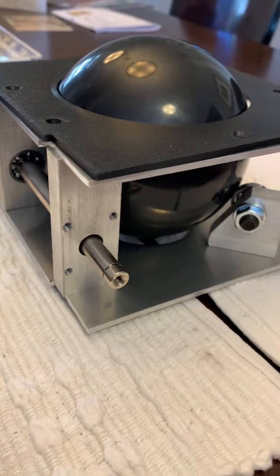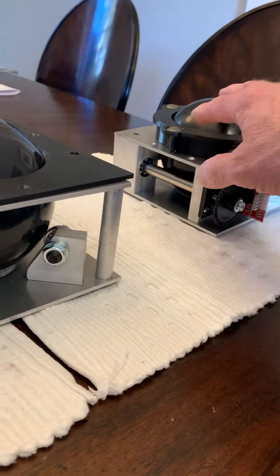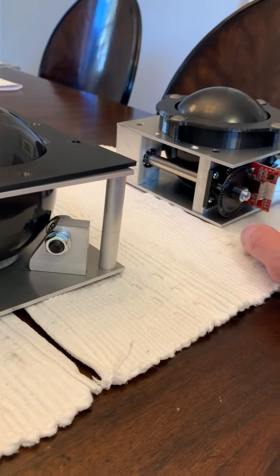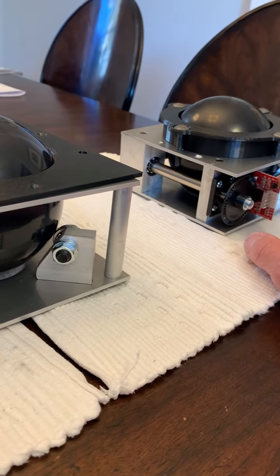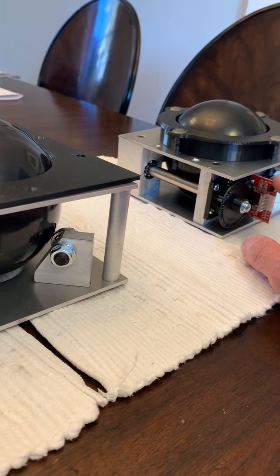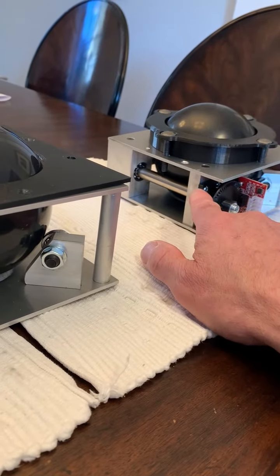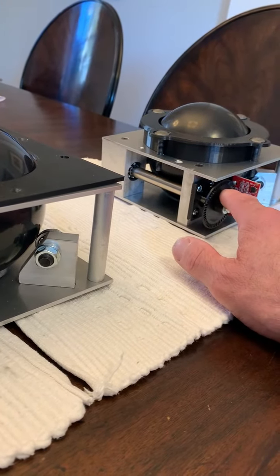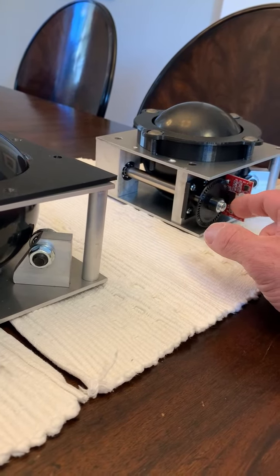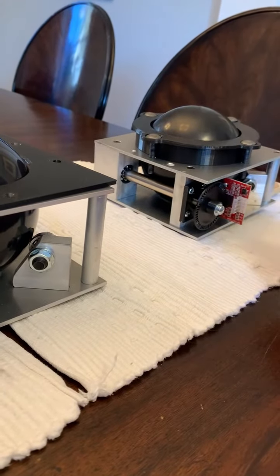My redesign is the same quality, just reduced height so that it can work with different kinds of panels. Also, you can't get the original optic PCB boards, but this one uses a standard red board you can get. I made the bracket and optic wheel with the same number of holes and gaps as the original wheels, so it should act the same speed as the original.